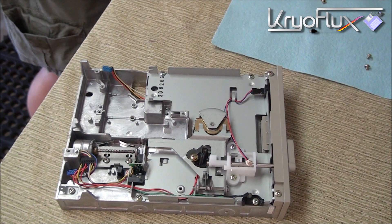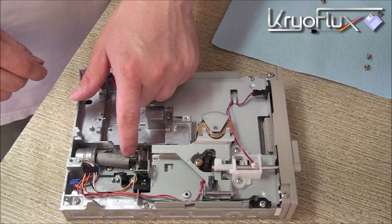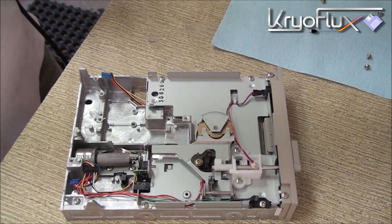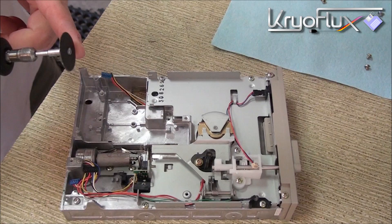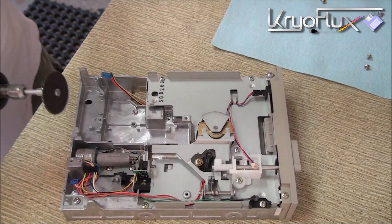In order to protect the lead screw, all I've got here is a scrap piece of aluminum tubing with a slot cut in it. I can just set it right over the lead screw, and then when I use my Dremel tool against this section right here, if it runs off and hits this it won't damage the lead screw. Making sure that I'm wearing proper safety gear and using just a general purpose cutoff wheel on my Dremel, I'm going to go ahead and very gently and carefully remove that shaded section of the stop.